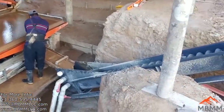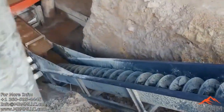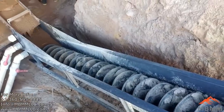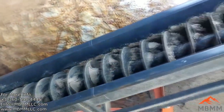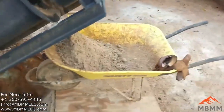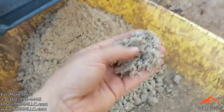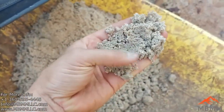These guys' goal is to process the tailings through a spiral classifier, as you can see here, auger out the oversized quartz, and re-crush at a later date to liberate more gold. But because a lot of their gold is so coarse, they have to do a coarse crush and concentrate first, and then they can come back later and capture the fine gold once it's re-crushed again through the hammer mill with a finer screen.